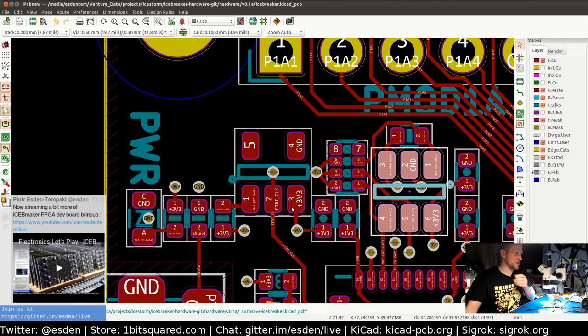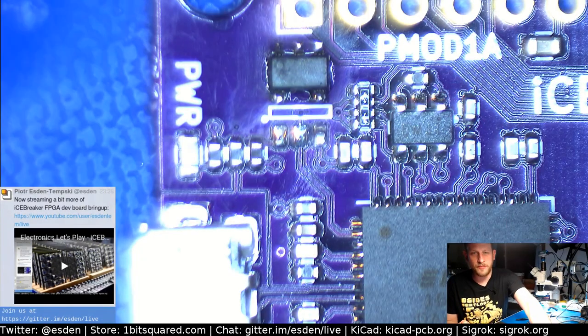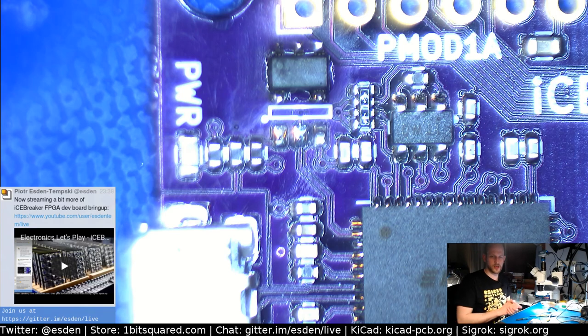So what I had to do is, I thought, oh well, the chip next to it is just the oscillator, so let me measure if there is a clock coming out of it, because it's a new chip, I have not used it before, so I might have screwed it up. Then I connected the oscilloscope here in the back to it, and there's no clock, what is going on? Then I took my multimeter, there's no clock, everything is static, what's going on here? So then I looked it up and immediately found the issue.